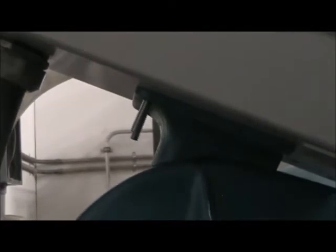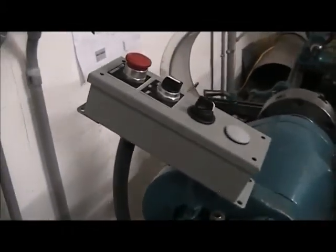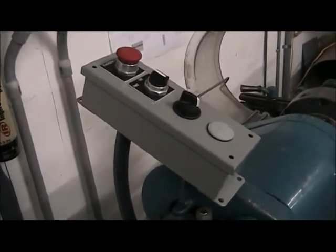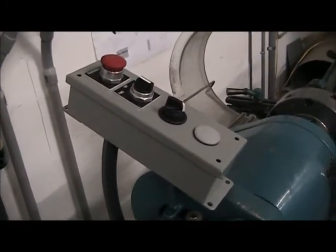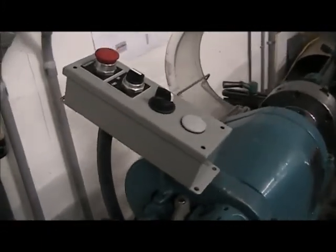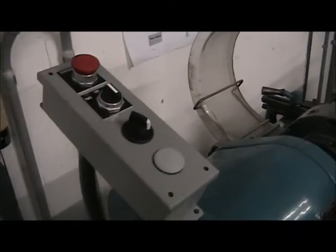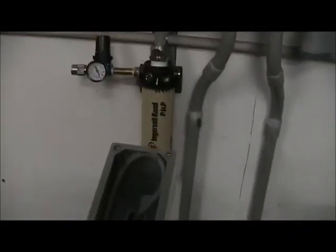What I did with my remote is I actually mounted it in the spot where the old mount was. Just drilled a few extra holes in the bottom of this four-control box here, and was able to actually wire everything up through there and bolt it on where the old one was — no problem. Didn't have to make any modifications to the lathe itself. But here's the inside of my case.